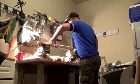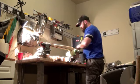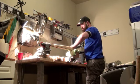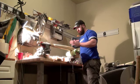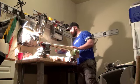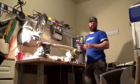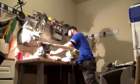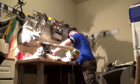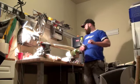Right, that's my first set of marker points hit. I've left about 3-4 mil to play with. I try not to be too aggressive down this end. A lot of people would probably say that I fettle rather than get sort of tucked into this particular area, but as I say, it's a preference thing. It's what you're confident and comfortable working with, because as I say, you can't put the wood back in.